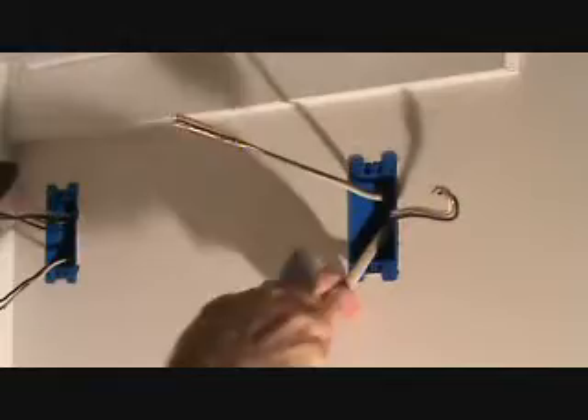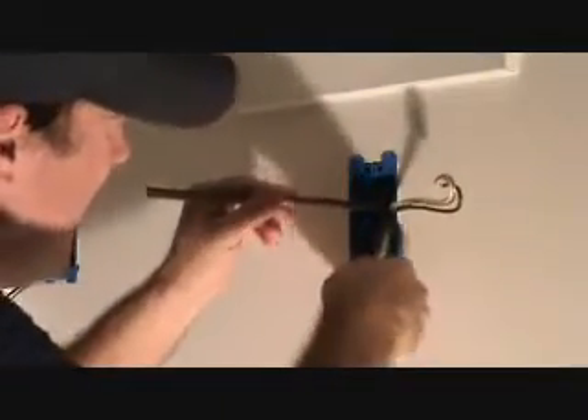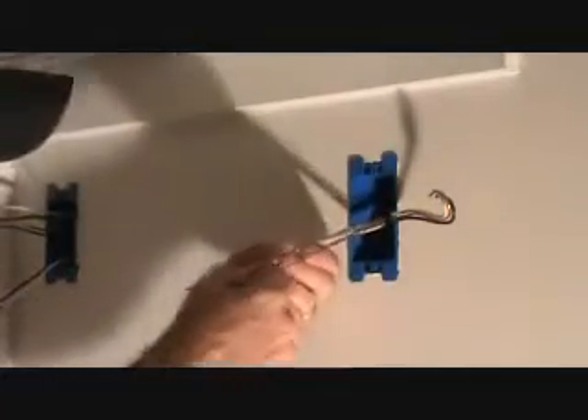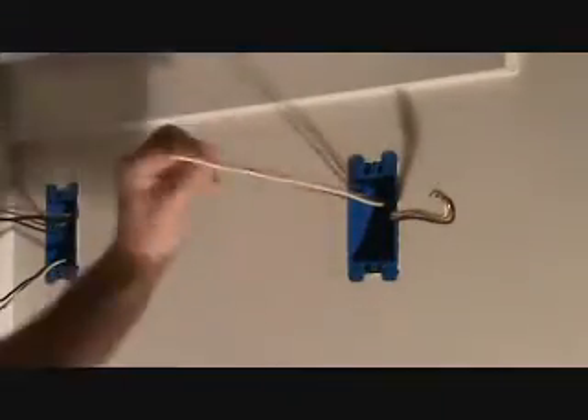Retract your blade and get that up out of there. Pushing the rubber back because I want to get most of that cut off. It's still coming out of the back side of the box a little bit and that's fine. There's a little piece of paper back there I can't reach so I get my little pliers out. There's only so far back you can cut the sheathing, but you want to get it back far enough to allow the extra slack in your wires when we push it all back after we hook everything up. But you don't want to get it all the way back to where you don't have any sheathing of the cable coming through the box — you've got to have that. You don't want just the wire exposed outside of the box.